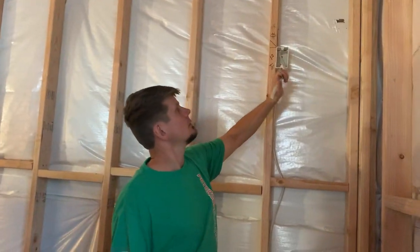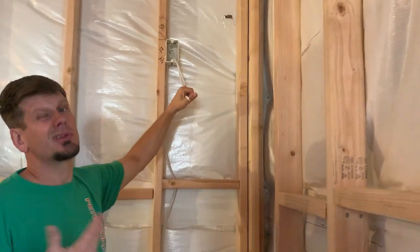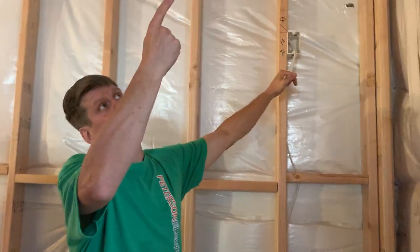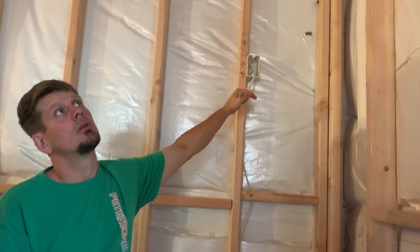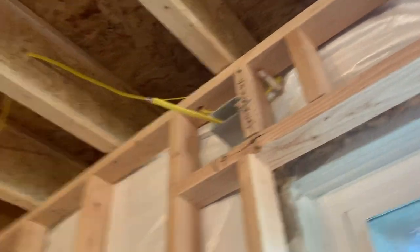They first thought they were going to do a glass fireplace with a 1,500-watt flame — I told them don't. If the basement is cold, put in cove heaters instead. We've got another one at 59 inches — you can get a 73-inch here. Surprisingly their wattage is very low — only about 170 watts per linear foot. Compare that to baseboard heaters at 225 to 250 watts per linear foot, and they do go up in wattage as they age — kind of like an old car sucking more gas — up to about 250 watts per linear foot at 30 to 40 years old.